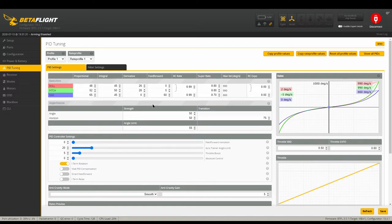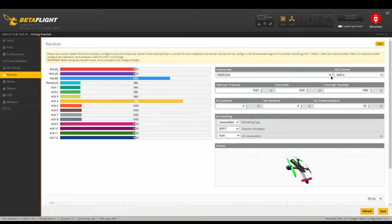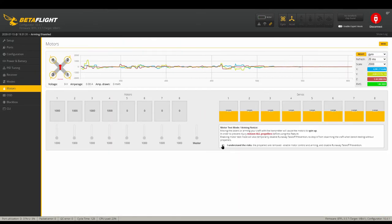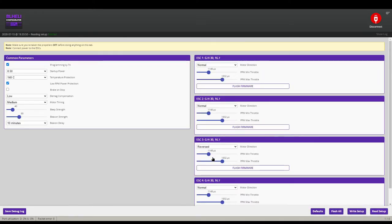My PIDs are no secret — I just got them off of the website where I bought all my components. Now we can head over to the Receivers tab to make sure that the receiver and the transmitter are all working well. I always have to change my channel map to TAER1234, and I'm also setting my AUX channel to RSSI on AUX channel 4. Here are my modes in case you're curious. We're going to head over to the Motors tab, plug in a battery, take off your props, and make sure all the motors are spinning in the correct way. If they're not, just head over to the BLHeli suite, click Read Setup, and then whichever motors are spinning the wrong way, just change them to reversed. In my case, I had to change motors 3 and 4. Then click Write Setup and that should get you all sorted.